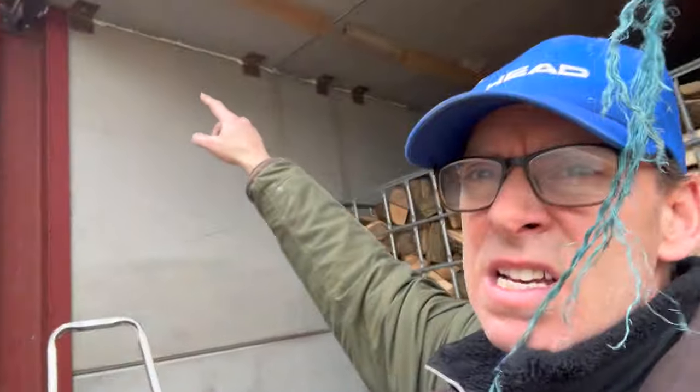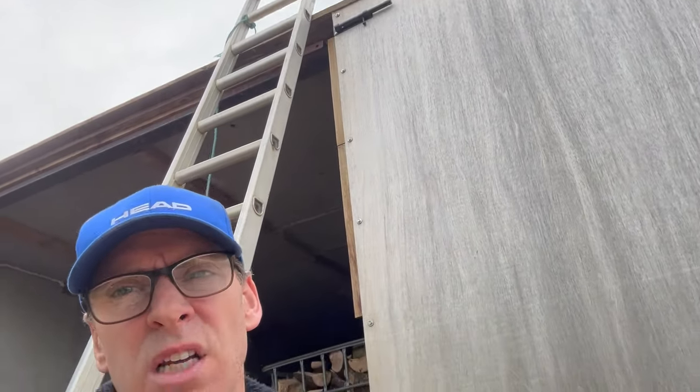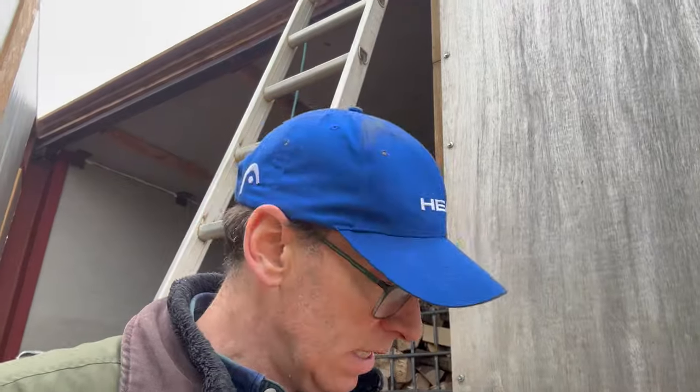Because when I was just drying logs, it didn't really matter if I was losing a lot of heat, sort of venting out the edges of the kiln, because it kind of got rid of the wet wood moisture. But now I'm trying to push it all into that. I've gone along the top there and just sealed it all up. We've got a hook to just close that door, and then I've got this bolt, which I'm just putting in over the top, up there, so I can lock over the doors, hopefully, and just try and get another sort of 5% drying out, I hope.